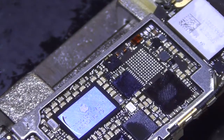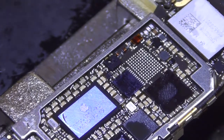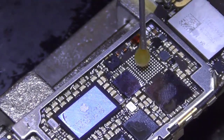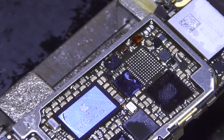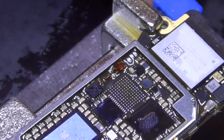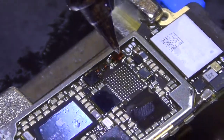When the solder is ready, it will become fluid — almost liquid movement. You want to take the IC out in one shot, avoiding any damage to the pads. As you can see, there's no lifted pad on this one because I took it out in one shot. If you play around with it, there's a risk of lifting pads. It's not the end of the world if you do lift a pad or two — it depends on the connection, as some are actually no-connection pads. This is a physical property of lead-free solder, which is made mostly of tin — not the most stable solder.